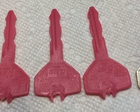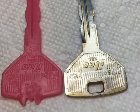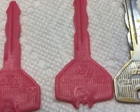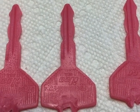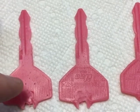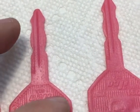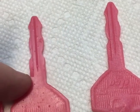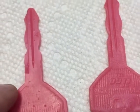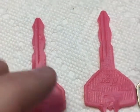Here's a look at three of the keys that I've injected. I think they turned out pretty good. On the back side there are some micro bubbles - some bubbles like you see here that I'm not concerned about. There are some little convex bubbles here that I can pop off. That's not a big deal at all. I'll definitely want to get rid of those, but the little concavities you see here, I'm not concerned about that at all.